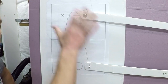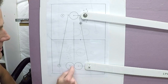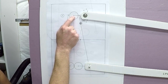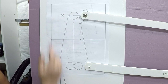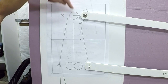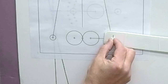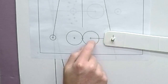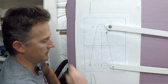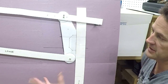This is a front profile of the connection points on the chassis that I'm building. These two points right here are the inch-and-a-half tubes that are butted together. I drew up this inch-and-a-half tube up at the top — 10 inches up. This tube is not actually on my chassis yet, it's just projected so I can move it around. This point is set, and so is this point, which I have an inch-and-a-quarter off of the tubes, because that's what I did on my first chassis and it works out really well.